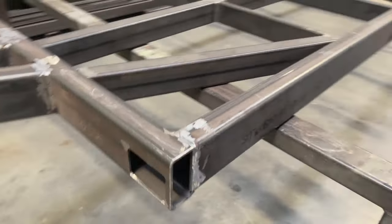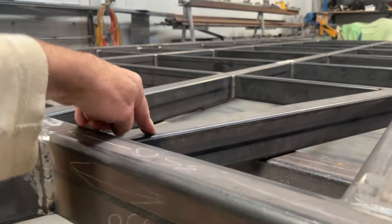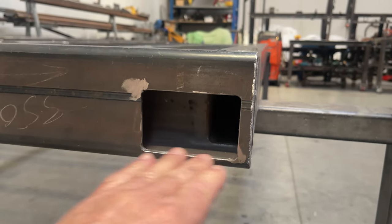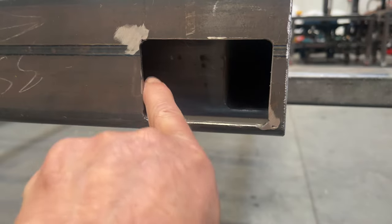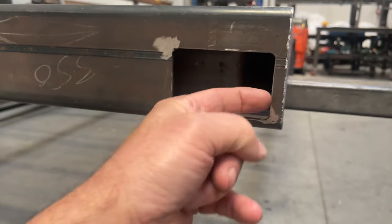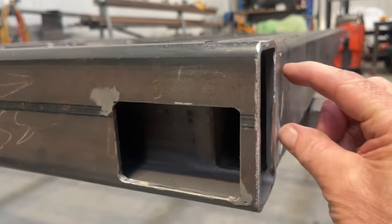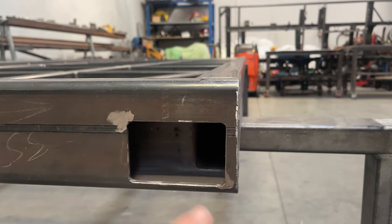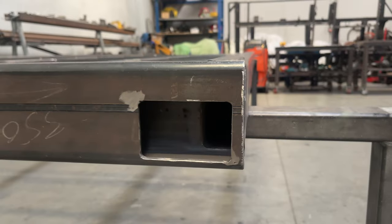Other holes in various places just help with letting fluids and air get in and out of the steelwork, especially where it's joined. Up here we've got a gusset in the corner that's completely sealed — we've got to get the galvanizing material in and out because it gets very hot. This corner is specifically done in 5mm for the crossmember and the 100 by 50, whereas the other material is 75mm and 4mm or 3.5mm. When cutting these holes, drill the corners first, then use your grinder — that makes them nice and round with no burrs. Clean them all up because you don't want burrs with wires running through. We've cut this corner out so we can get in and do up the nuts and bolts on our 90-degree key pieces for the air line, and this area will be covered with a blanking plate that screws on and leaves it serviceable.